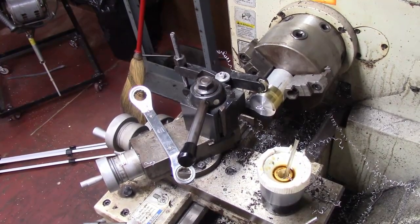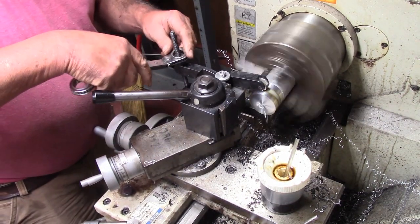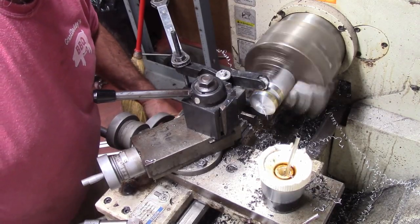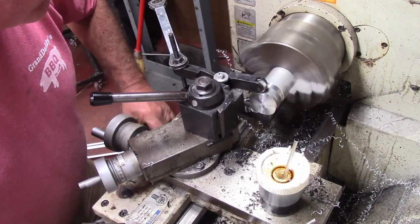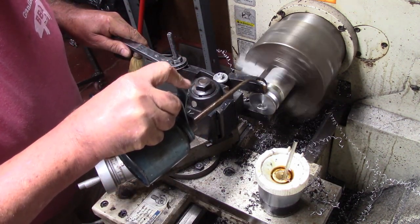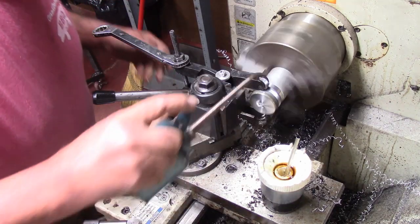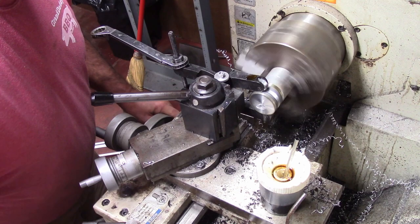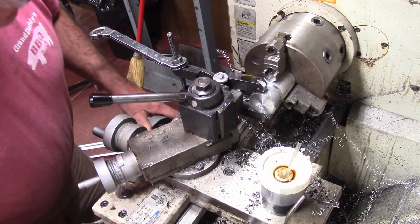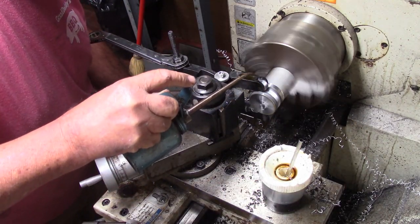Now we've got to sort of figure it out. I've got an area here I'm going to knurl. I'm going to run the knurl to about 200 RPM. I'm just going to go back and forth right in here. Some of this will be machined off, but this is kind of going to be a little decorative area. We're just going to have this knurl in the area we're going to machine off. This is cutting oil — kerosene, not WD-40 or anything like that. I prefer to do most of mine with oil.